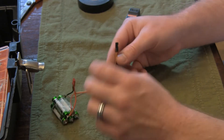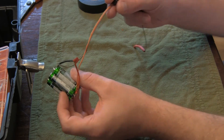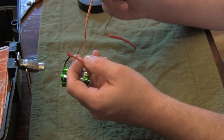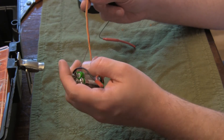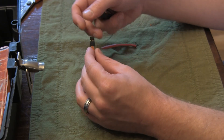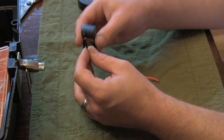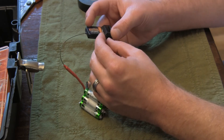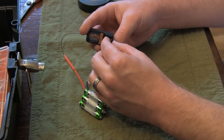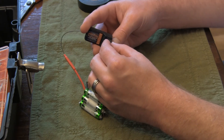It works great for binding. This pack is dead — it doesn't have enough power to power this up right now. You're going to have your servo connector. The positive on these is in the middle — it's the middle wire, which is red. Brown is your negative, and it will be right next to the red. If you're looking from the top, it will be to the right of the red. Now if you look on your receiver, this one's not labeled.